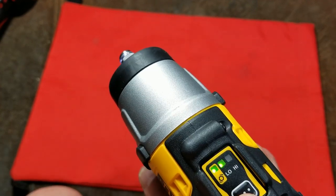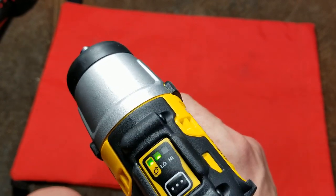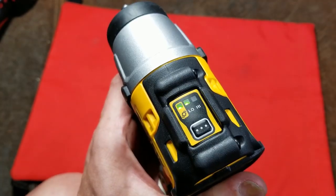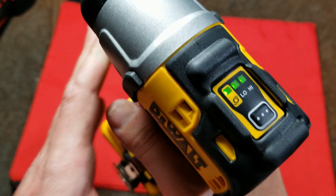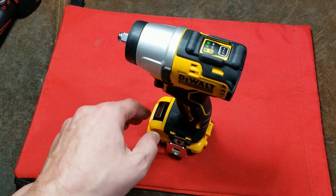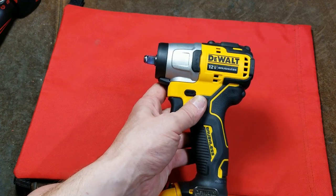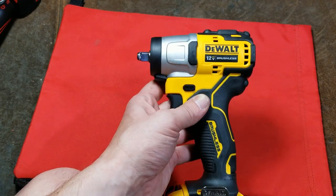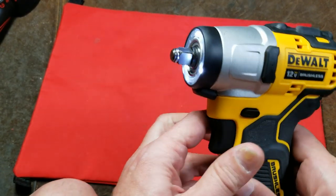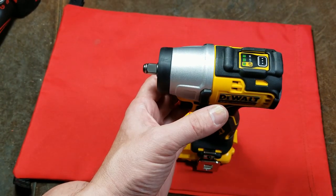My other big criticism: in low mode it is low, but in reverse on low it's full power. I'd prefer it to just be low in all directions when set to low. High is of course full power. They're advertising 125 foot-pounds of torque — that's the nut-busting torque, which I don't quote, but it seems to have a definitely respectable amount. Using an adapter, it's actually really nice for driving screws just like any other impact driver, with the convenience of throwing on common 3/8-inch impact sockets.